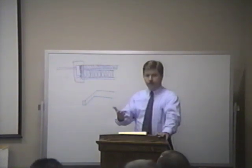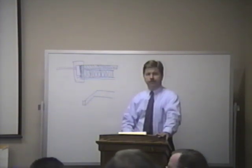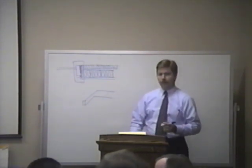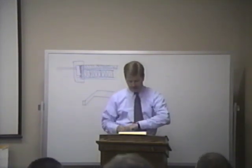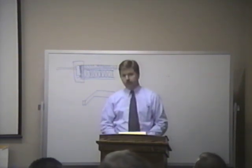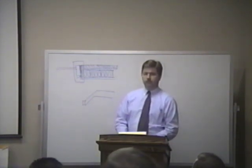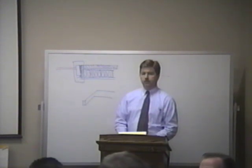ASHRAE standards used to be 0.75, wasn't it, for air changes on infiltration rates? Like 0.75 or something like that. Well, you're talking about the design standards, right? For the buildings themselves, yes. Right. Like the book says, 0.3 is an extremely low number. One air change an hour is really quite a low number for residential type construction. And in commercial construction, the bigger the building, the volumetrics change such that the number gets smaller, but there's a lot of areas for leakage. We try to pressurize buildings in commercial work to counter ventilation.